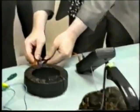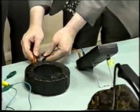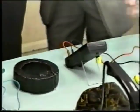The basic output will vary, but 183 volts. 193 volts, okay. It was a constant. It'll vary a little bit, but it should stay right around 183 volts. If you would be, this is a standard 100 watt light bulb, 120 volt. So you're looking at that voltage. You're looking at a bit over an amp of electrical current.